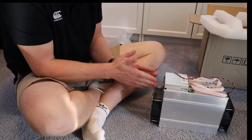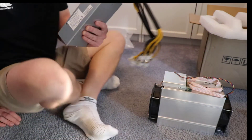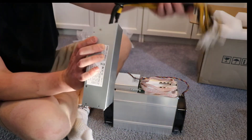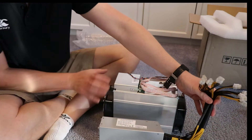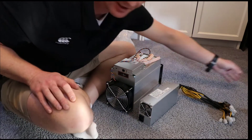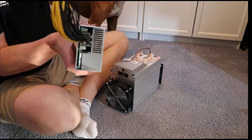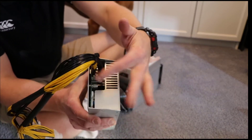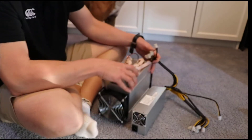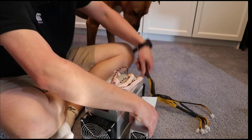I find 150mm ducting pipes in Australia — and perhaps around the world — just clip straight onto the front. What I recommend is: get everything ready on the floor. That is, lay the power supply unit down and have it in the layout that you would have it when it's in the actual mining rig. This is important because you don't have much room in these cables, and you want to make sure that each cable is under as little pressure, resistance, or angle as possible. As a result, you should lay it out as I have just here. Note that there's a high side and a low side — the power cables are at the top, not the bottom. Position those cables at the top of the machine; that way you've got another inch, and every inch matters, to put them into those cards at the top. You'll definitely need every millimeter, otherwise you have to prop something under the power supply unit itself, which I don't recommend.